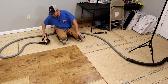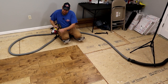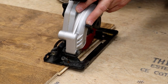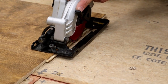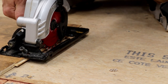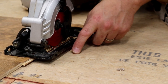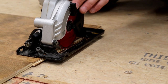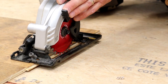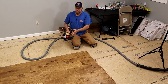I'm going to take my circular saw and set it to the depth of the wood. I'll release the guide so it can go up and down freely. You can measure it or look at the markings. I like to lower my blade until it just touches the floor, then lock it down right there. That way I've got a precise depth — my blade is just going to go through the wood. It might barely score the subfloor, but that's okay as long as we're not going halfway through it.